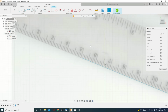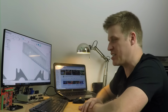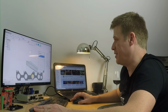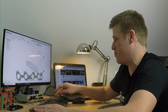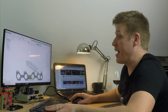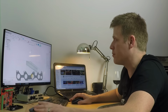There you go. So now we do the same thing again. We click and we're on 99.936. So we are 64 microns too far away. Okay, I'm actually going to do that one more time, because that's a little bit too far away for me. I mean, it's the engineer in me coming out, to be honest. Anyway, it gives me the opportunity to show this. As soon as you click OK, so we put 20.1 in here, I actually have to finish that sketch.